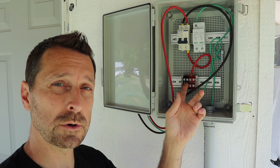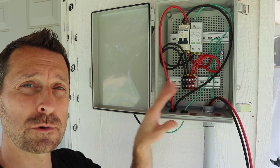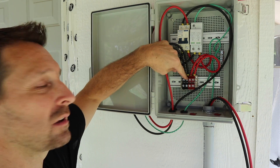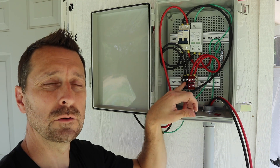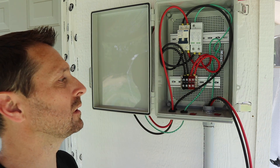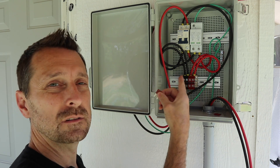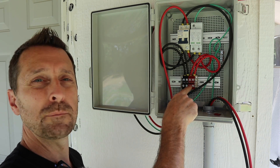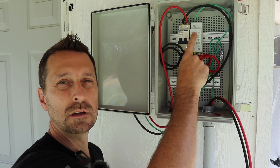Let's get the rest of these jumpers made and then I'll show you something cool about this Dinkle din rail. We have almost everything completed — our PV lines into our breaker, down to our Dinkle rail, and up to our SPD. But we need a way to bridge between these two lines and that's what these little jumpers are for. That's why this Dinkle din rail is so cool. We're going to plug in these jumpers between them and that will bridge them so it can run up to our SPD.